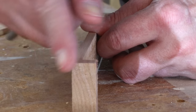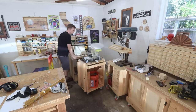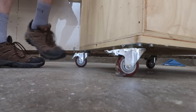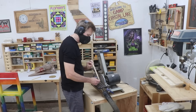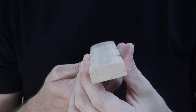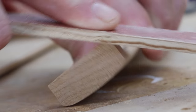I want the outside of this spine to have a little bit of a curve to it, just like a regular book spine. So I'm just going to make a mark here where I want that curve to end up. I'm going to shape this using my disc sander. If you don't have one of these, a random orbit sander works fine — it's not a lot of material to remove. And that's all the curve I'm looking for on that spine. I need to round over these tabs a little bit so that the cover can open and close. I'll probably need to refine that a little bit more once I start to assemble this.